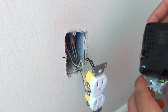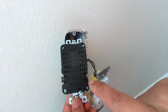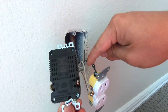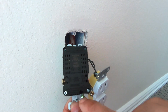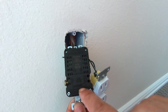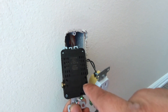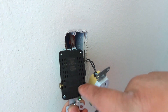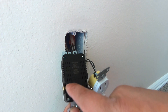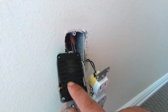What you want to do is get those hooked up on the new plug. The white cables go into the two holes on this side. We're going to straighten out and strip the copper wire bare — there's a strip gauge showing the strip wire should be about a little more than half an inch, that's how far it should go into the holes. The two white cables go into these holes and the two black cables go into these holes. It doesn't matter which is up or bottom because they're both shorted together.